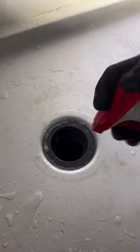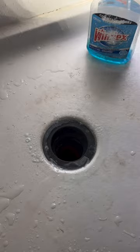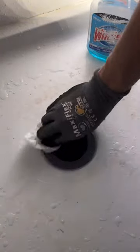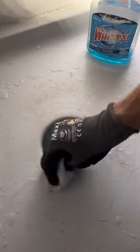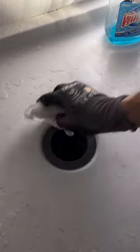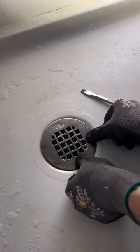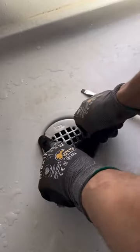These drains are really easy to install — that bracket makes it easy to tighten down. I was asked if I've ever dropped the bracket down the drain before, and I said no, but I almost did right there. It got stuck on my screwdriver, otherwise it would have fallen in. Also, I like to spray silicone with Windex — it helps give it a nice clean wipe. Once I get that cleaned up, I put the cover on, check for leaks, and that's all there is to it. Since it didn't leak, I'm on to the next one.